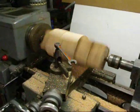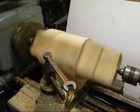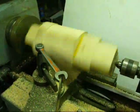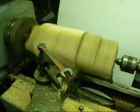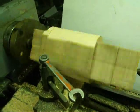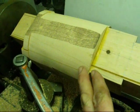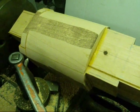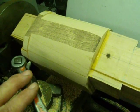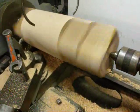We're turning maple now — it turns nice as can be. I'm running the lathe at a fairly slow speed until the workpiece becomes perfectly cylindrical, because there's a lot of balance variation when you've got a glued-up piece. It's looking good so far but there's still an awful lot of wood to be removed. Let's stop and take a look — pretty nice finish too. Pattern makers often use sugar pine or mahogany and some other rather expensive woods; of course maple is expensive too.